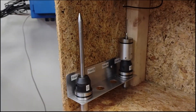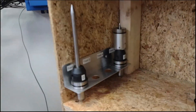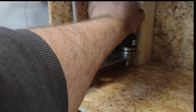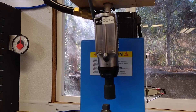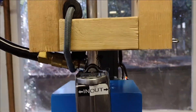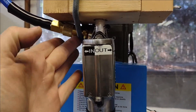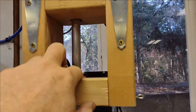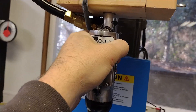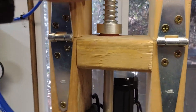And then of course the KP3 kinematic touch probe — I'm putting that in the very back corner to make sure it's protected. I will put the case cover back on it once the video is over, and I'll probably 3D print a cover that slides down as a cap over the top. Acorn wants this to be tool number 10, so I put it as tool number 10. Quick addendum: I did add a bungee cord, but it canted the rod and was still making it bind a little bit.